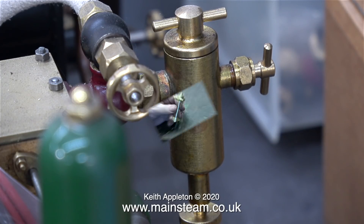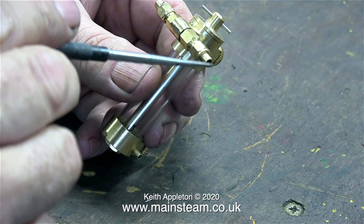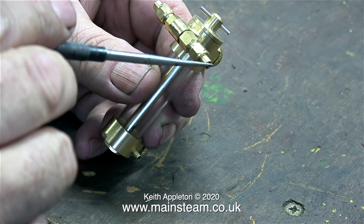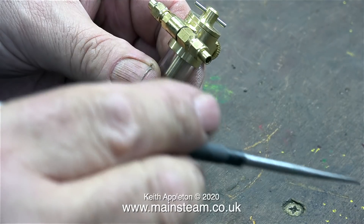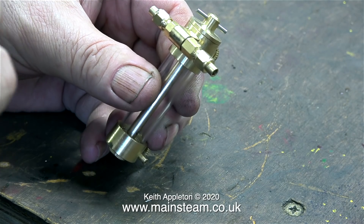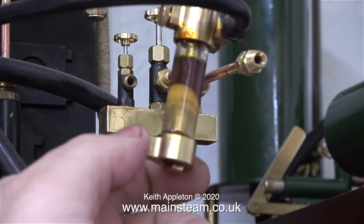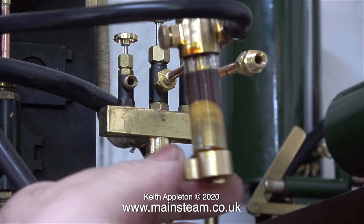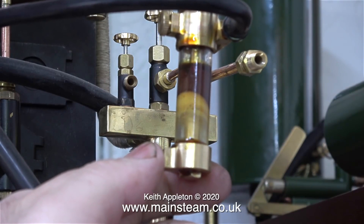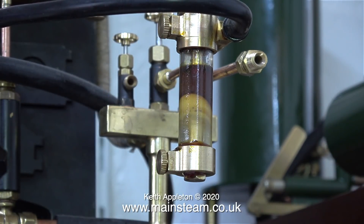Here is a very unusual form of displacement lubricator made by a company called Microcosm Engine in China. This one has a through pipe so you can just insert it into a steam line. One problem is that the steam line unions are fitted to the body using silicone O-rings so the lubricator is not held rigidly — as you can see in an application I used it for, it wobbles about. Because this small lubricator is made of glass you can actually see the displacement happening — fairly clear water at the bottom and dark brown steam oil at the top, with an emulsion in the middle where the two meet.